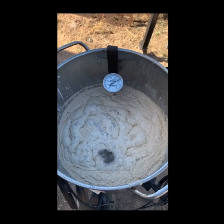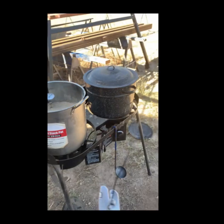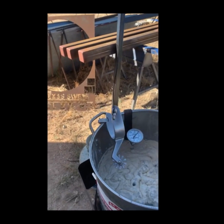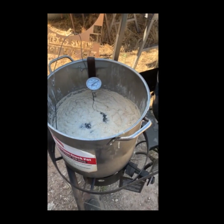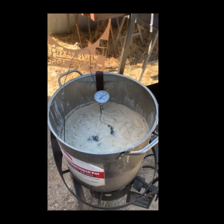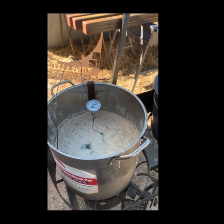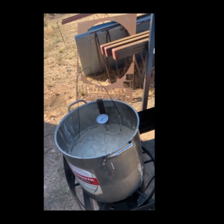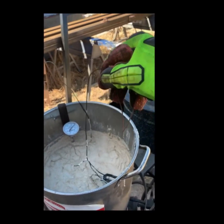Now the salts are boiling and you want to make sure this salt does not get on you. It will stick to you and burn your arms real good, so you want to wear gloves. I've got hangers on my spurs and the hanger comes up out of the salt so you don't have to get down near it. I've got it boiling just at 315. When you put your spurs in there it's going to quit boiling for a few minutes and then it will come back to the boiling point. It's real important to have it boiling at that temperature.